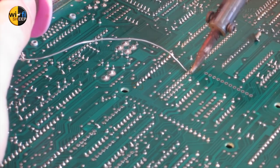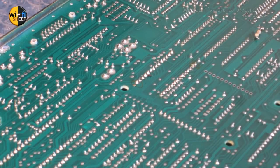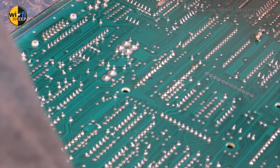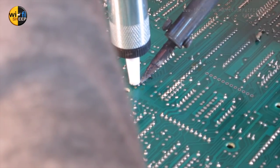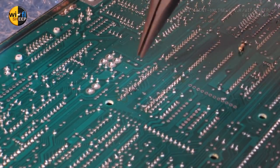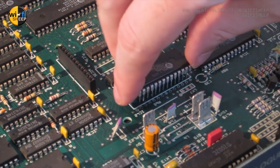I have seen this trick done on other YouTube channels with great success, generally with vintage TV repair people. That's floating a bit of fresh solder on. Now, solder pump - people said I didn't use it properly, so we'll try using it properly. That does actually work better - I wasn't using it right. Now I'm just going to make sure there are some pins slightly bent over, straightening up the pins, and we'll see if we can actually get this to come out. After a little bit of fiddling around, the old ULA chip was able to be simply lifted out of the board, and as you can see, I got it out intact.